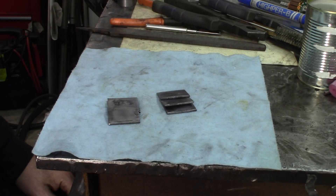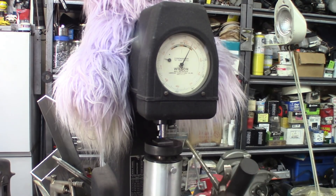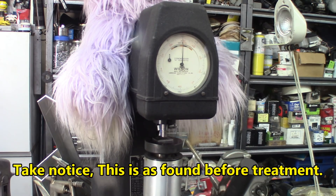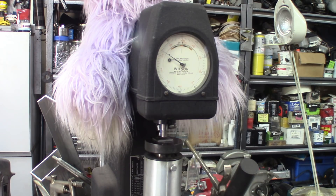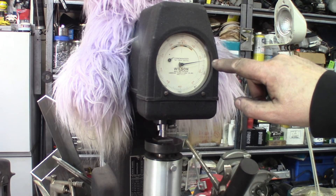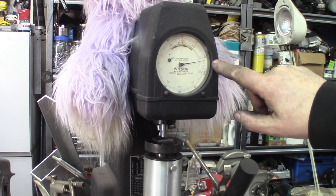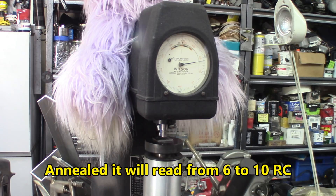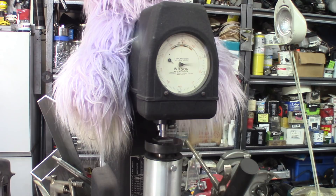Let's go to the next step: how hard are they now? As a first test, we want to know the hardness before we start doing something with it. Let's test the untreated piece. Set that to the testing zone, zero it, release. It's going to do one complete cycle — the indenter did its pre-dent and now it's indenting. The untreated piece, as-is from the bed rail, is 22 Rockwell C. Not soft — normally cold-rolled steel is under 10 Rockwell or even softer. So this is already hardened; there's some heat treatment already present when you get the bed frame from scratch.